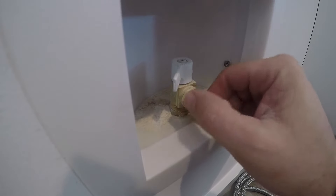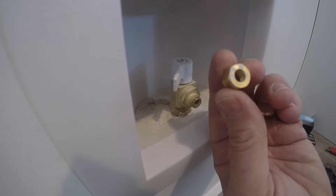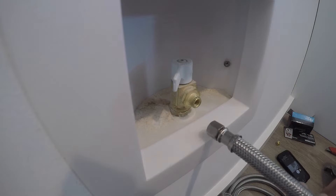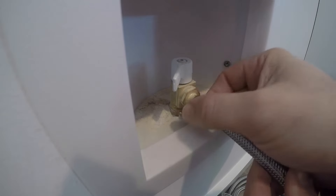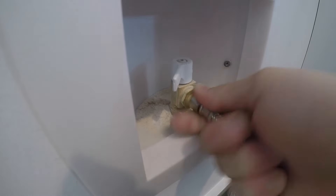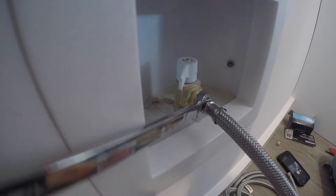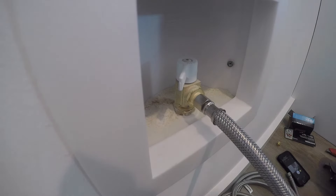Connecting this to the valve is pretty straightforward. It came with this compression fitting — if we were using a small water line we would use this compression fitting, but we're not. Instead we're using this braided line, so we'll attach it. The procedure is pretty straightforward: you put it on there and hand tighten as far as you can. Then we put our box end wrench on and turn it 180 degrees — a half turn — just to snug it up against that rubber bushing in there that we showed you earlier.